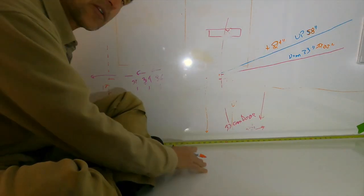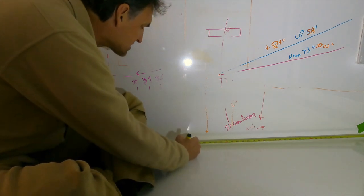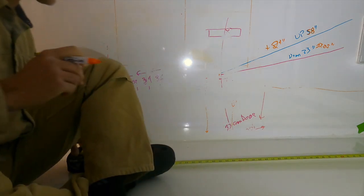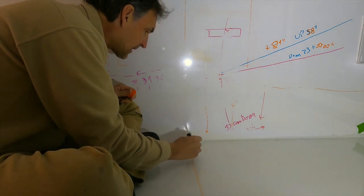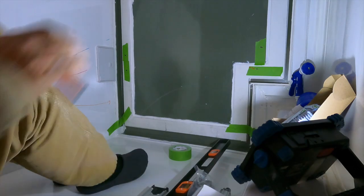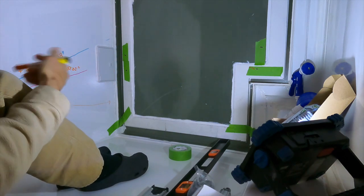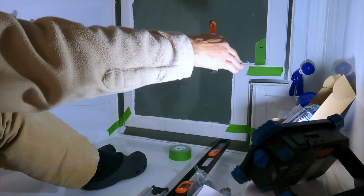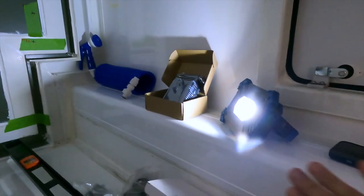I'm going to go from the center line — it's much easier than going from each side. Fortunately my center line is exactly the same from each end of these doors. Here's my 39 and 1/16th measurement. I'll mark that as my CL center line. I've got my door pulled in to where the seal should be. My trick to doing that is to lean something against it — use physics. So I've got that position and now I need to measure how far in to put my mounts.